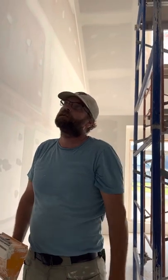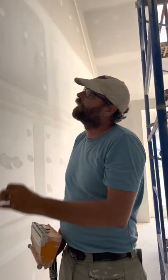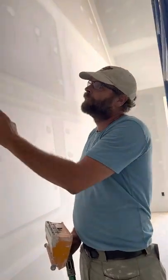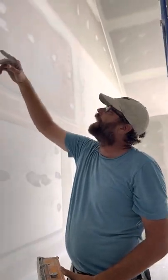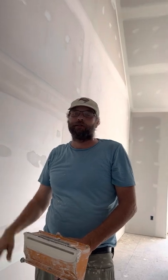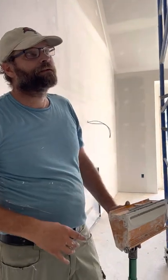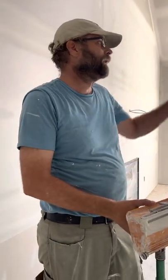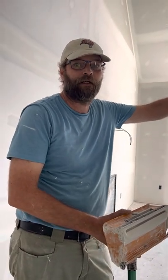Whenever you run your beads, you're always going to leave some kind of little goober because you're trying to go fast. There are usually a lot of them in a house or a commercial job. The last detail I want to use is a smaller blade, because it also allows me to go through while spotting my screws, filling my angles — I can see any blemishes in the board and take care of them at that moment. So when I'm ready to sand the house, it's completely done and really easy to sand. Anyway, that's the process. The next video will be skimming corners — I'll have a few more beads in this house, then tighten it up to three-ways and the skim coat will be finished. You guys have a good day and I'll talk to you later.